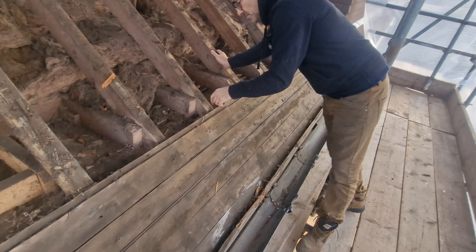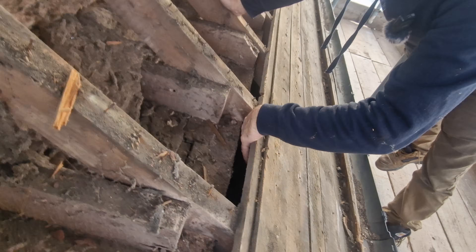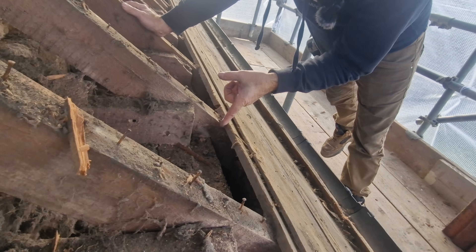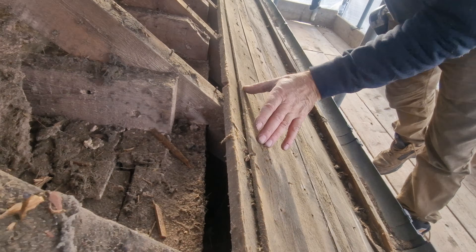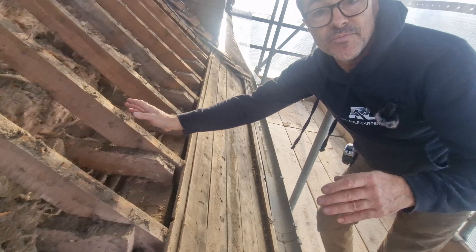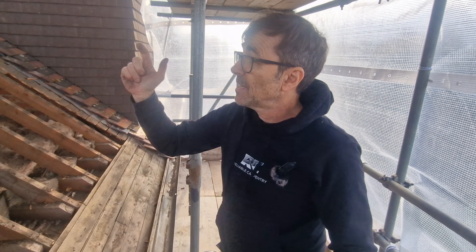Another thing that's common in a lot of roofs: where the rafters carry most of the load forces, they start to slip off the back of the wall plate. Where they would have been nice and tight, it's all eased back. Again, if something spreads or drops, that's what happens.